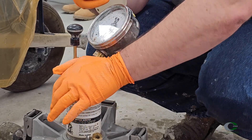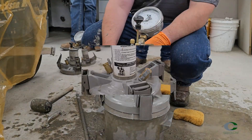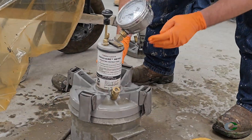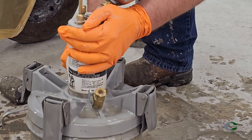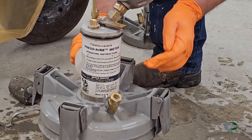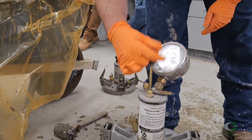Make sure the main air valve is closed — in this case it is a push-pull lever. The petcock should be open, then inject water into one of the petcocks, slightly jarring or tipping the pot towards the injection side while filling. This will force the air bubbles out the opposite petcock. Do not inject water into one petcock then inject into the other — stay on one petcock, otherwise you will continue introducing air and chasing it out.